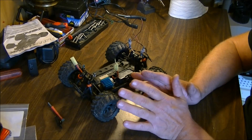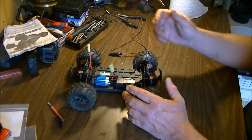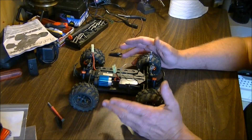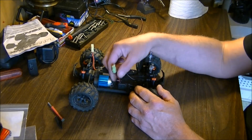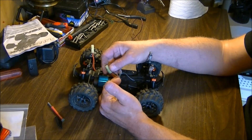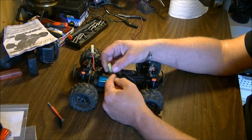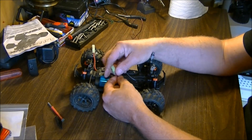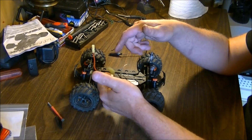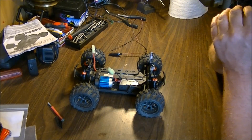I'm not responsible for any of the mistakes you make. I just know of ways that you can do it, and it's very simple and easy to do. It is very important that if you are going off your battery connector to your ESC, then you need to strip the wire casings back somehow, and of course your wires have to go on each one. You decide whether or not you want that fan to push air on or draw air out.